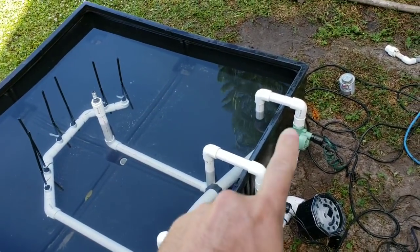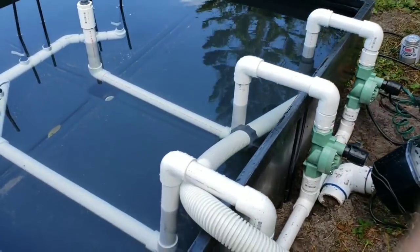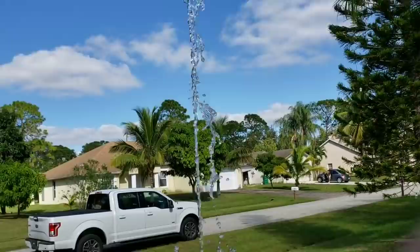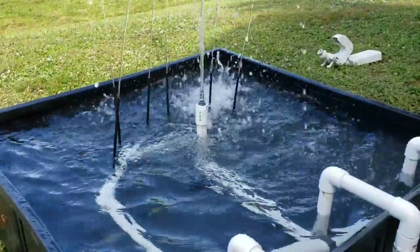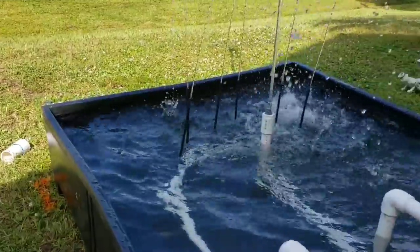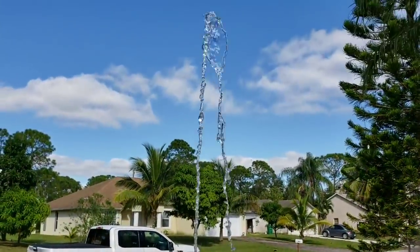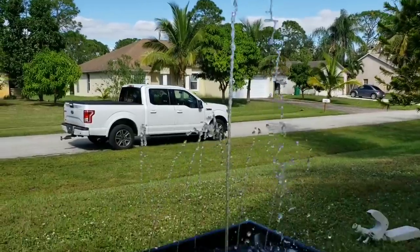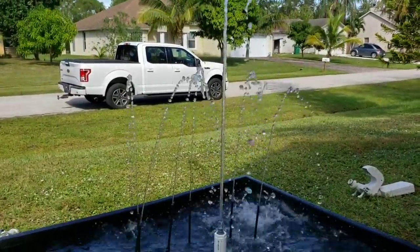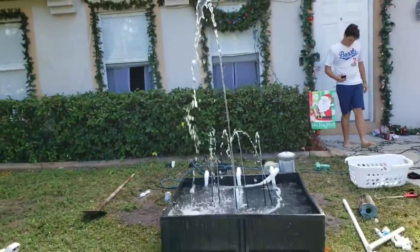We had to change a valve to a full one-inch down because reducing to the smaller size created too much back pressure. With all the jets on at the same time I do need to adjust the nozzles to make sure they're all pointing straight up so water splashes back in — I'll get some oversplash and lose some water, but hopefully not a whole lot. I'm gonna use some fishing line to tie things up. The main jet shoots up probably about six feet, and the six little ones go about a foot and a half to two feet.